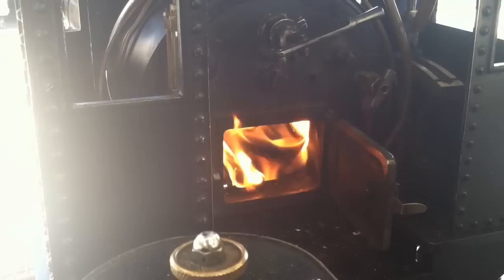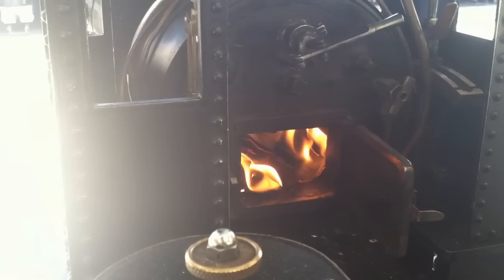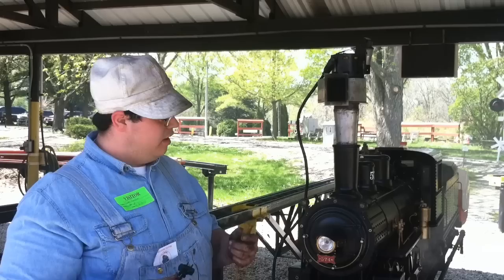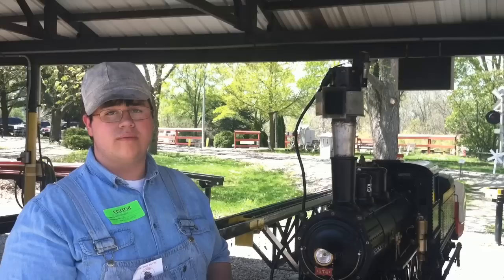When you're done putting the fire in the engine, it's always good to make sure you close your ash pan, otherwise you'll have embers falling down and possibly lighting things on fire. You have to keep a draft on the fire to keep it going, otherwise it'll go out. Many live steamers, like myself, use these old vacuum motors — they create a draft to keep the fire going. These are electrically powered and they'll start right up. Some guys also have airlines that directly connect to their locomotive to operate the steam blower and then switch it off later, but this engine does not have one of those connections.